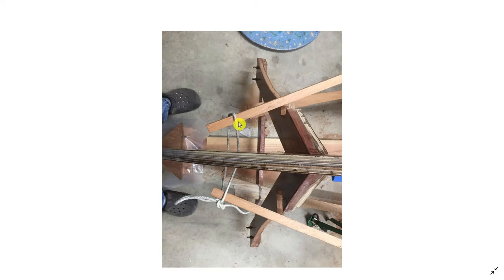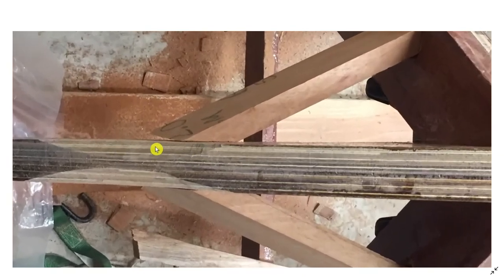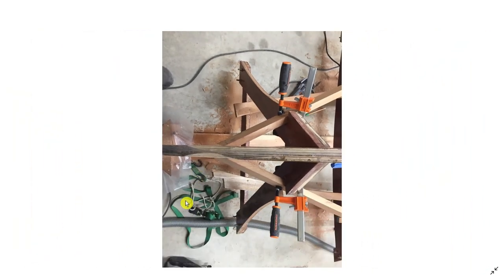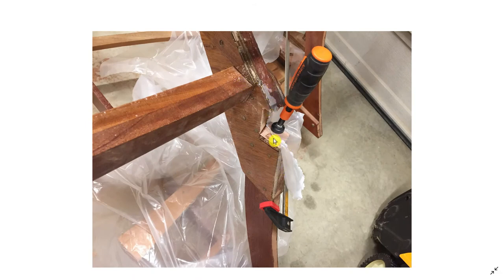Here I'm using a piece of rope to temporarily bend the chine logs in, just to see how they'll bend and fit. Then I'm using clamps to see roughly where it will line up at the stem, checking the angle of how it lands. It wasn't quite right, so I had to do more cutting with the Japanese pull saw to fine-tune that joint. On the transom frame, I cut my notch too deep from the outside, so I epoxied in a spacer. At frame 7, I also cut too low and had to put a spacer in there as well.